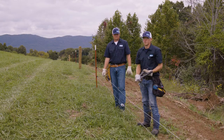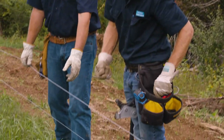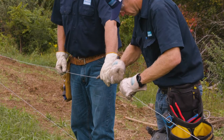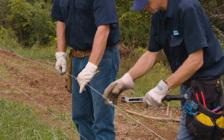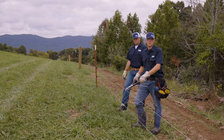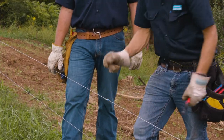Now with the Gripple, we're going to use our Gripple Torque Tool. The great thing with it is it does have a tension gauge on it, so I can be really comfortable with the amount of tension I'm putting on this wire. Using the medium Gripple, we'll go ahead and cut this wire, insert it into the Gripple — hear the click? We're at about 225 to 250 pounds tension. To finish up, all we've got to do is grab our cutters and cut the tail off. That's getting it with proper tension on it.